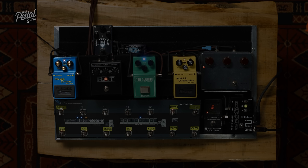Like talking about the Tube Screamer, it has got that filter in there and then different tone shaping afterwards. So where you put your filters and things in the circuit determines the overall sound. So interestingly with EQ, when we looked at the waveform directly after the diodes, but now with our tone circuit in, and we have a look at the waveform, it's very different. Lots of the time we've gone back to more of an elongated triangle shape as opposed to that hard edge thing. But the EQ is a massive part of shaping the waveform.